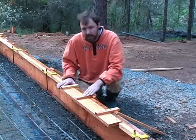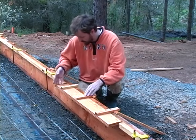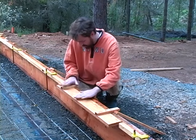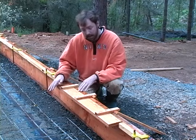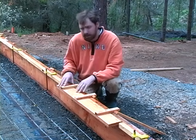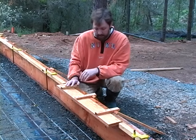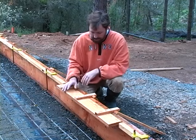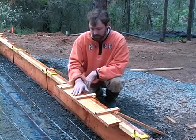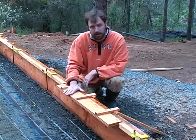I'm using another concrete cutout here. Basically it's a one-inch nominal thickness piece of plywood cantilevered out over the slab. The concrete will fill up underneath and around it, and when it cures this will end up being a notch that's the exact width of the door threshold. When we trim this out and bring plaster to it, it's a really nice detail that allows you to sweep stuff right out of the house without having to deal with the threshold.